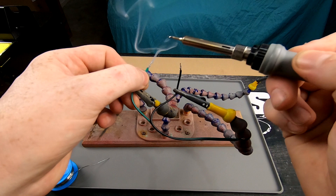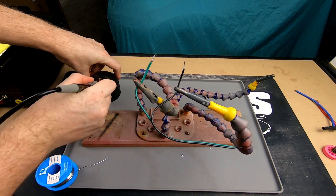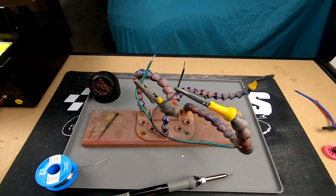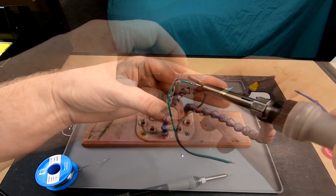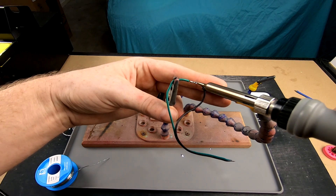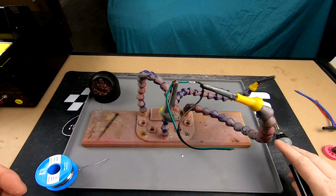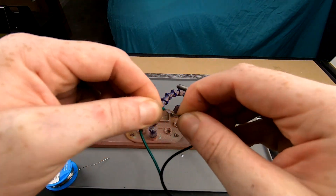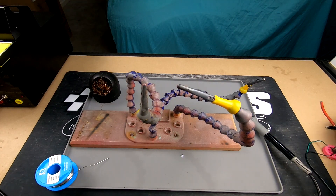It's not the most brilliant work I've ever done, but it doesn't feel like it's applying very nicely. A quick cleanup on the tip — as I said, a new tip normally takes a little bit before it's quite right. Let's try to get these wires joined together. And they're joined. See how strong they are — not the prettiest joint, but they're definitely soldered together nicely.